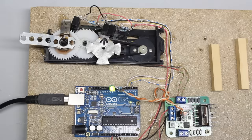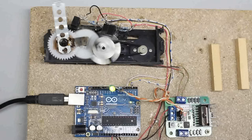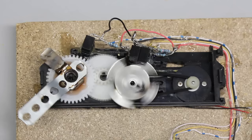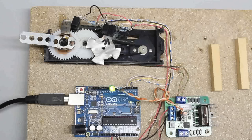As mentioned before, the angular resolution can be increased by using a sensor disc with more teeth. You can also attach the sensor disc to a gear wheel or the transmission instead of using the output shaft. The gear with the sensor unit turns with an average angle of 22.5 degrees per step when using a disc with 4 teeth. With a transmission of 13 to 1 from the sensor wheel to the output shaft we get just 1.7 degrees per step. Note that there is always clearance caused by a transmission, which lowers that theoretical value.